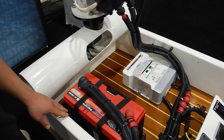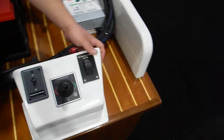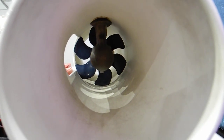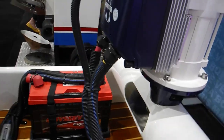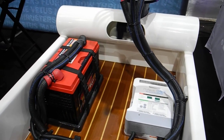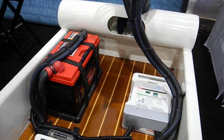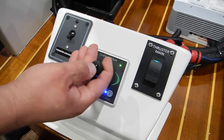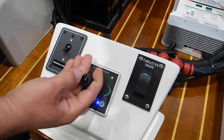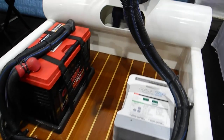Can you explain proportional? I'll operate this for you here. This switch is going to operate the battery kill — allow power to get to the system. I'll hit the joystick on. Thruster is running. As I move the joystick to one side, the further I push it, the faster the thruster is running. So the more you push it, the faster it goes, or you can slow it down. And you can also lock it in at any speed — push it, get the speed that you need, press that top button, and now the thruster continues to run and will hold you against the dock.